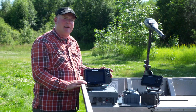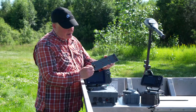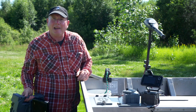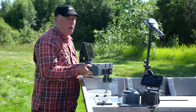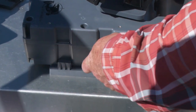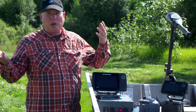One feature I really like is the mounting plates that allow you to permanently attach the plate to your boat using sheet metal screws. There's a little pull button you press to release the sounder. For my 20 amp hour unit, I simply pull on it, lift it up, and I'm ready to go — a little carrying handle makes it easy to take to my vehicle or house to charge. It also lets me move the unit from boat to boat. To reinstall, two indentations clip into the base plate: slide it in, pull out the pin, push it down, and it locks back in.